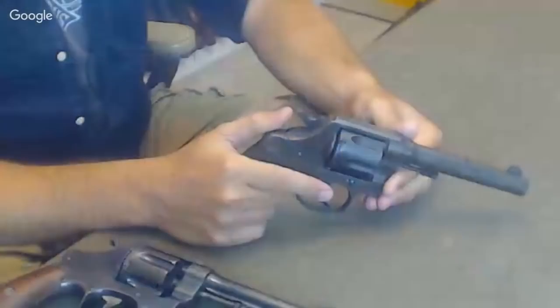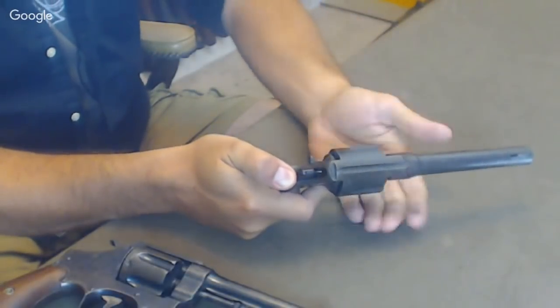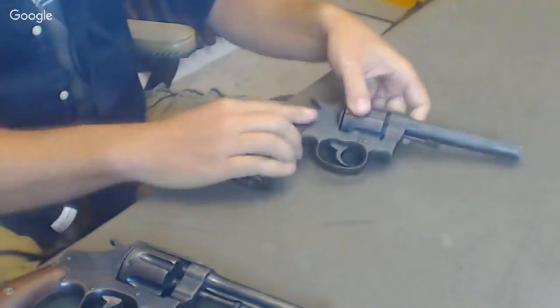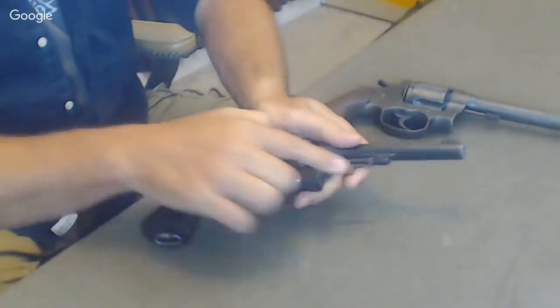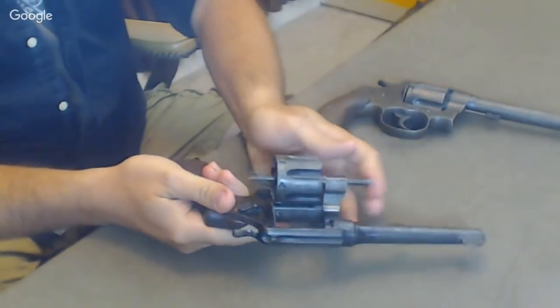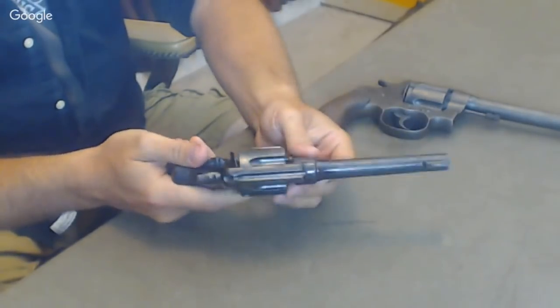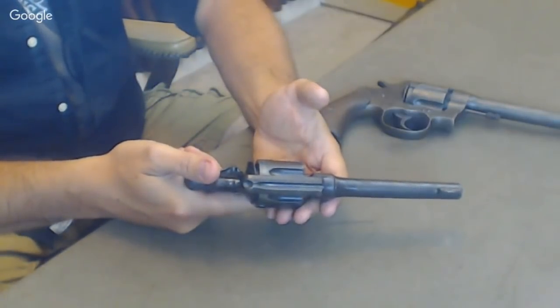It's hard to beat either the Colt or Smith & Wesson revolver from that period — both are fitted and timed so well. Colt changed their rotational direction so the cylinder torques into itself and doesn't walk out of time over years of use. Smith & Wesson kept the same leftward rotation but added a reinforcer — a spring-powered dimple that rests on a notch at the front of the ejector push rod — that keeps lateral pressure off the crane, preventing it from walking out of time.